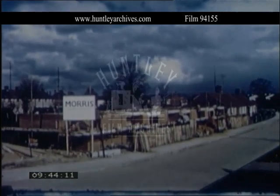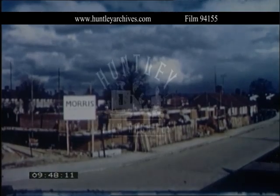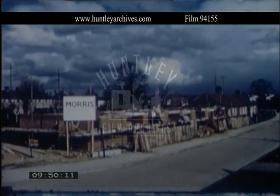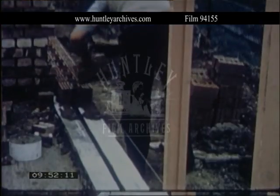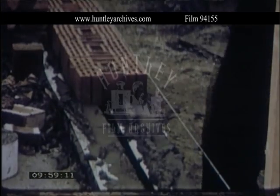This was obtained at Aylesbury, where a group of bungalows was built using V-5s for all external walls above damp-proof course. A cavity wall of solid brick was built up to damp-proof course, and V-5 bricks were laid on this so as to continue the cavity.